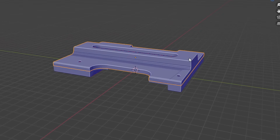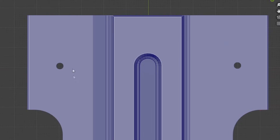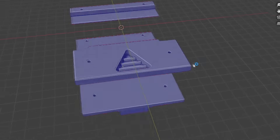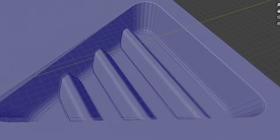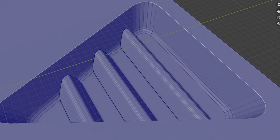I made mine into a split pattern, so there's a clear top and a bottom, and because of that I added some little pin holes — an eighth of an inch — for locating dowels when putting them together. I also added some more draft and fillets. The big difference is this inset triangle thingy right where all the shrinkage was worst in the last attempt. I went with a triangle because of my channel logo, but I decided a couple of straight bars are much easier to model, so I did that. No one's going to see this part anyway.